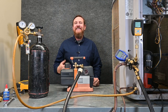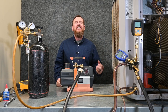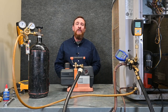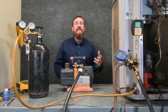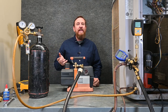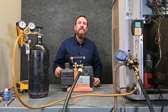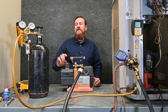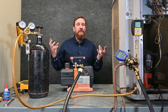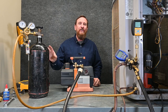That's one of the most important things nitrogen does. The second thing is, in the very unlikely event that some moisture could freeze — which is extremely unlikely and really only seen in commercial applications where we have water-cooled condensers and a big leak with a volume of liquid water — the nitrogen pressure raises it up and allows that H2O to melt back into a liquid. Another problem is if we put too much nitrogen pressure during our triple evacuation, the water vapor that's already loose will actually condense back into a liquid on the surfaces inside the coils. So we make sure we keep that pressure low.